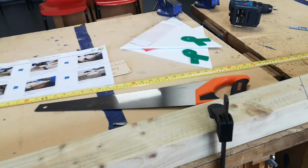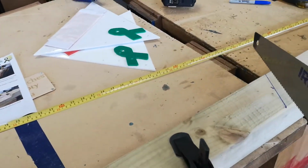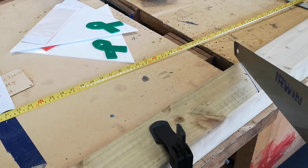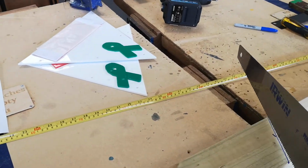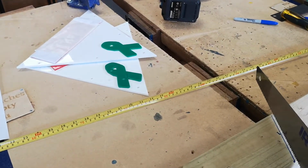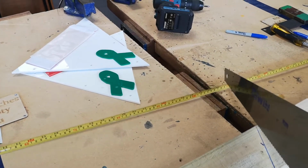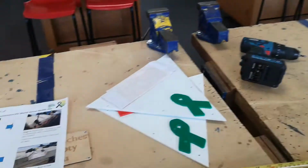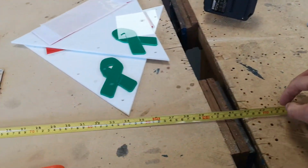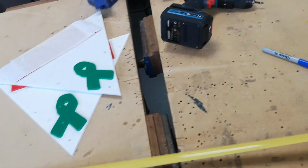A little tip would be, before you start sawing, before you start that cut, move your tape, because as soon as you get through that cut, you're going to end up coming forward with your saw, whatever you saw, on either tearing or cutting completely your tape. Even if you put a little nick in the side of the steel there, it'll tear eventually.